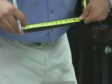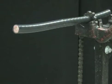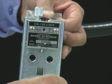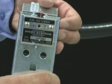Make a mark on the cable at the defined dimension. To ease the rotation of the tool, a thin coating of silicone grease or talcum powder may be used on the surface to be removed. Set the blade to the correct depth by turning the blade adjustment dial — each number on the dial indicates thousandths of an inch. The blade should be set to cut approximately 90% through the jacket.